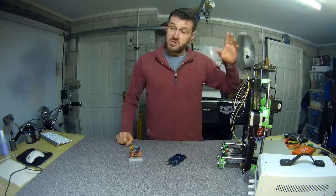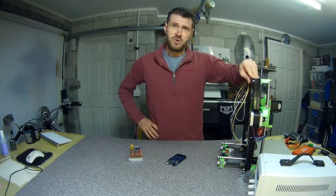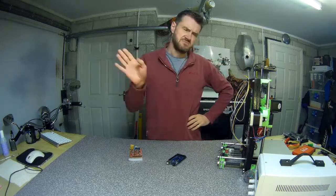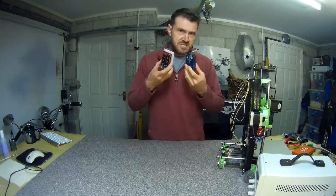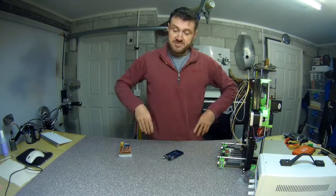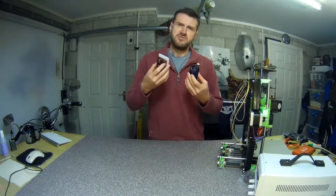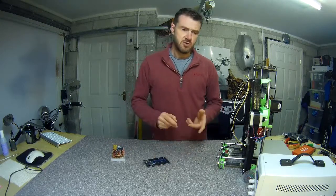I'm not using the standard Prusa arrangement because I'm not going to have it on the actual frame of the printer itself. Likewise with the roll of filament — I'm not going to put that on the frame either. Basically this is wobbly enough as it is, and putting mass high up on it I don't like the idea. I'll probably end up mounting the whole printer on a level base and making some housings for the electronics and the power supply.